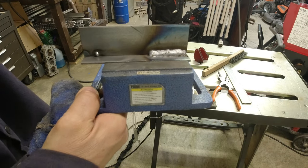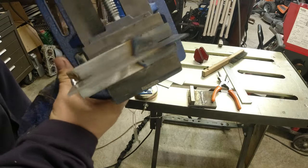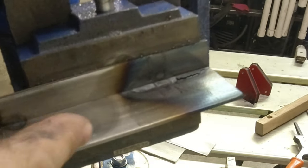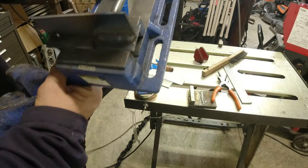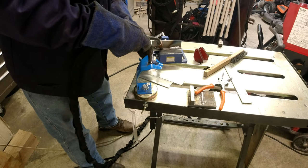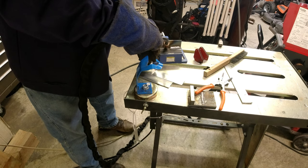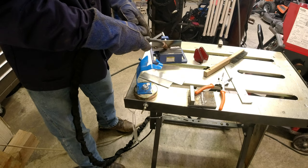It's just weaving back and forth. You can see it was starting to burn through the back side a little bit — so I'm running pretty hot, but it's got good penetration. That was pulling. Now I'm going to do one pushing — when pushing, I'm going to be closer to vertical and sitting on a 45 into that gap.